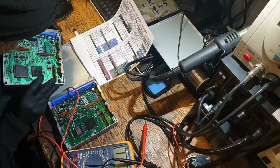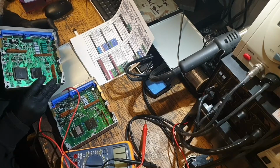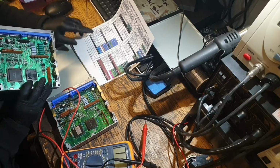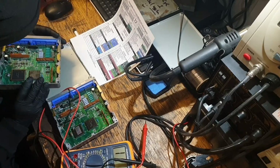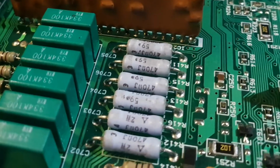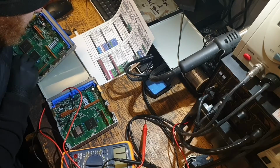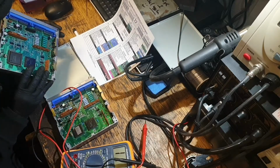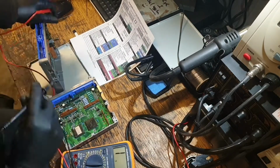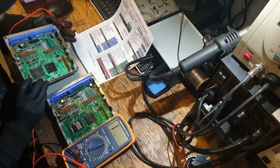Yeah, a schematic would be nice, but I'm not going to find one. How does that work then? Have I even got the right diagram? I'm fairly sure I do. Because where are the other 11, 12, 13, the ones below it? Yep, that all corresponds to those 6 resistors. Assuming they are resistors. They look like resistors. 470, yeah. 2 watt resistors. Yeah, if I go between ignition coils, it's just doubling up the resistance of those resistors because they're in series.